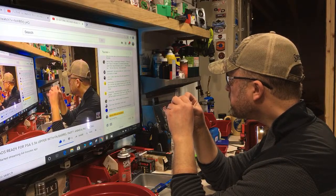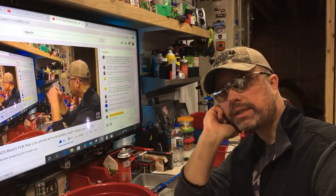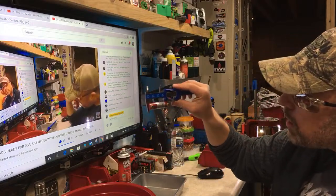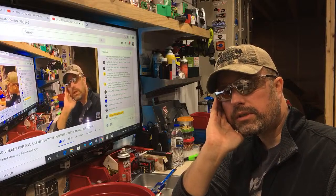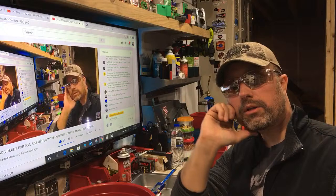Jinx Soldier saying, would be good to mention case gauges. And if you've watched my videos in the past, you'll know I don't use case gauges. I've said this in the past, I'll say it again. You reload for your rifle's chamber. You do not reload for a case gauge if you're going for precision ammunition. If you want more spray and pray ammo and you're doing something on a progressive press and you want something that works in a wide array of firearms, then yes, use a case gauge. But if you are going for the absolute most precision, you definitely want to reload for your firearm's chamber. If you're asking my opinion, I would use a bump gauge and not a case gauge. I sold my case gauges a long time ago. And if you watch my video series, you'll know that brass consistently, and I mean to the thousandths of an inch, consistently fire forms to your particular firearm's chamber. And I will bump that brass from fire form 3 thousandths of an inch for semi-automatic, maybe 1 to 2 thousandths for bolt action.